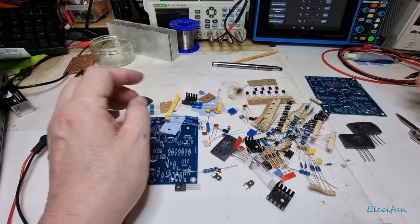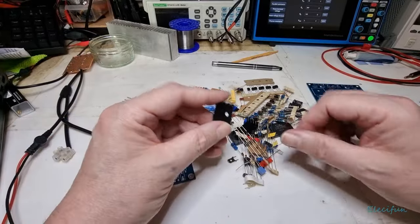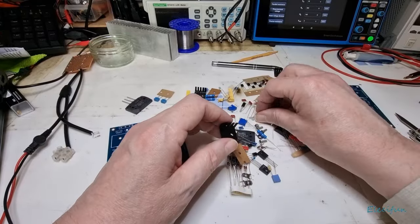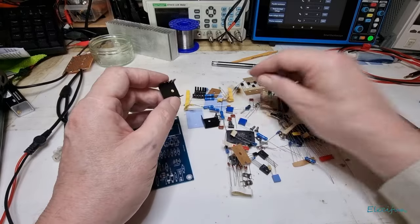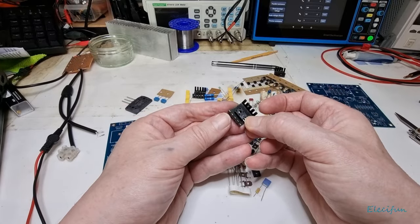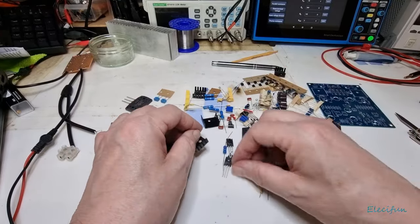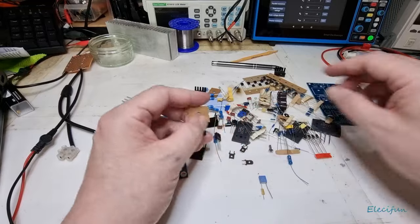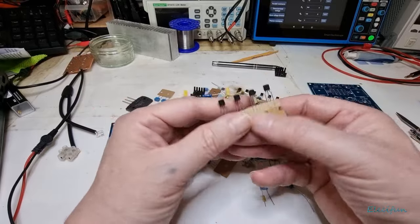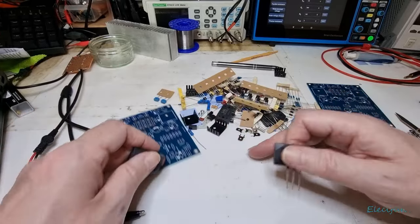So this is the next kit to build up - two channels. These I believe are going to be for the smaller little transistors, not the TO-92s like these, but for these ones. There should be four of these going to get heat-sunk onto the board - must be generating a little bit of heat there. The 5551s - yeah. So that's it then, this is the next package, the next kit to build.